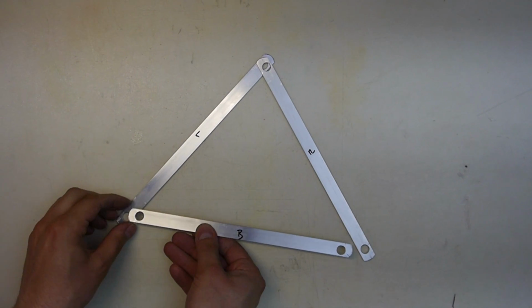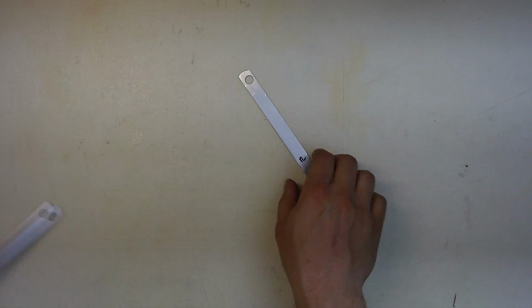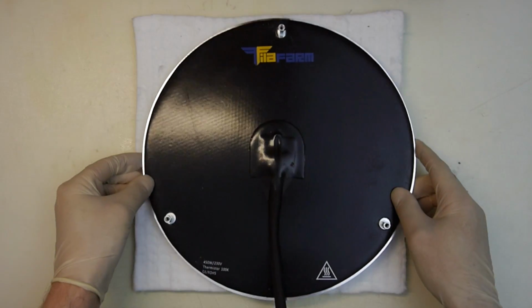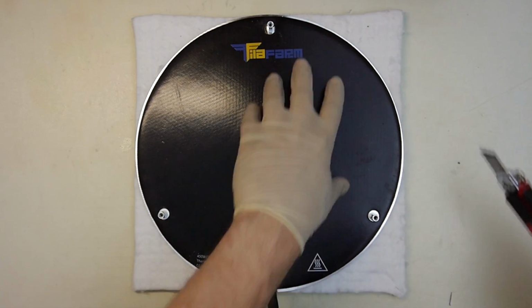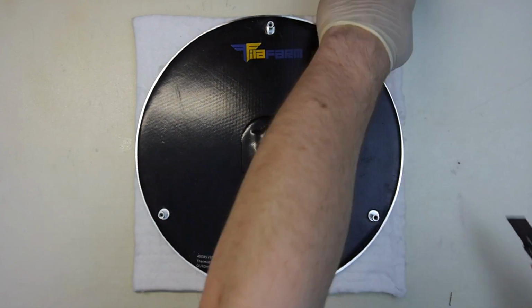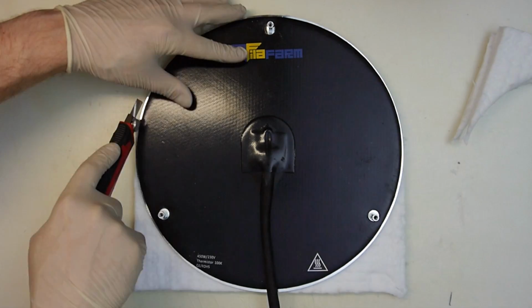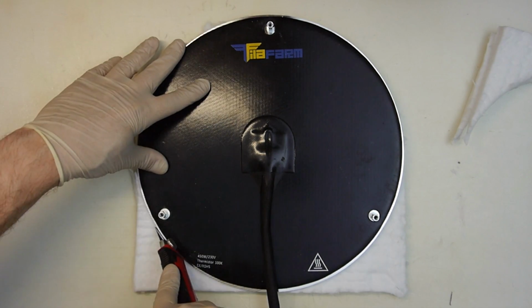These bands are not screwed onto the frame, but will be held in place just by gravity and the slightly compressed wool. The wool can easily be cut with a sharp knife. Avoid contact with your bare skin, wear gloves, if possible a respirator or face mask, and try to avoid getting the dust and fibers onto your skin. I realized that a long-sleeved shirt would have been a good idea too.